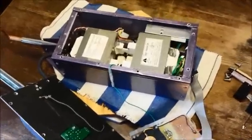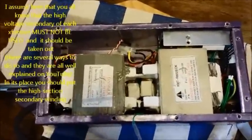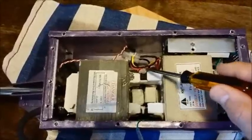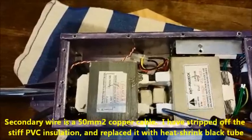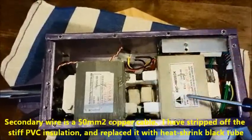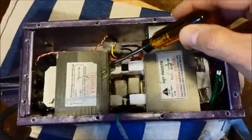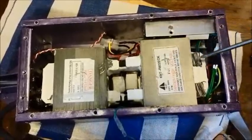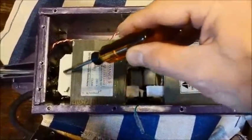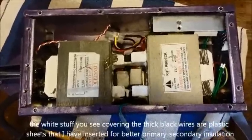The first point is about the way I wired the secondary of the two microwave transformers. I know it's hard to see because I've poured hot glue on the secondary wires to prevent them from vibrating when powered. In a nutshell, I ran two loops of the secondary wire with each loop going through both transformers — each thick wire comes out of one transformer and straight into the other, reverses, goes back in and out again, for two loops. This way I obtained the same effect as connecting two separate secondaries in series.